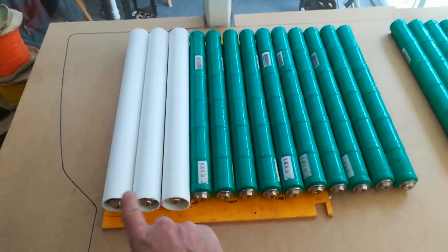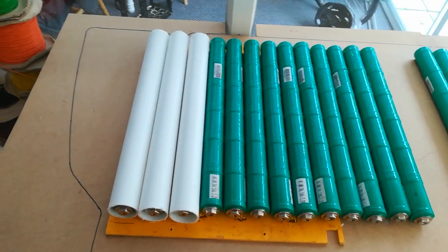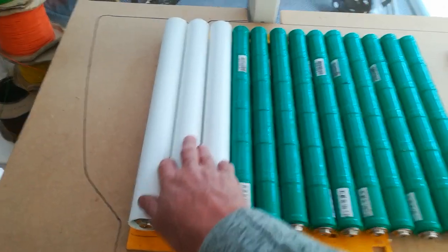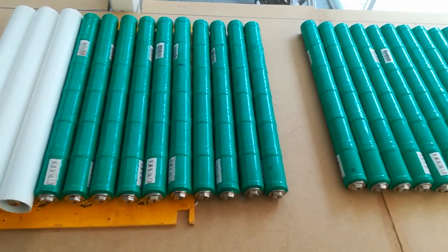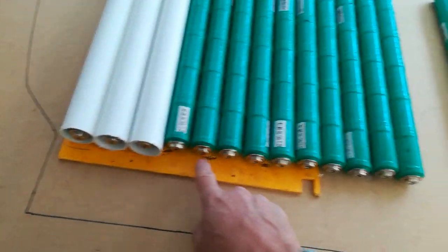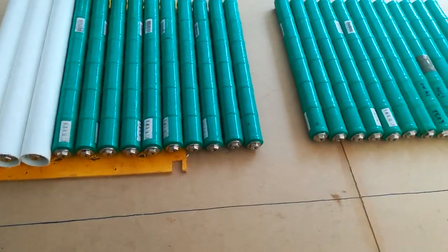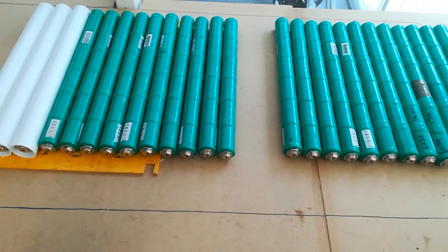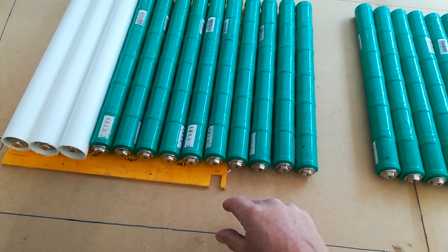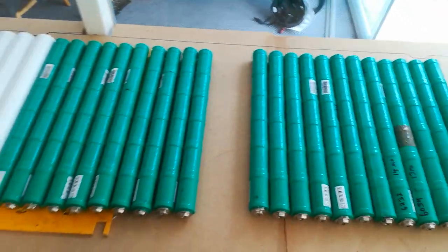Once you've got the tubes on a piece of board you can just stick them down with tape initially. With your sandwich on top and the edges all sealed up with expanding foam, that would seal all the tubes into the construction and make it very rigid — if you filled in all the gaps it would be really pretty strong. Probably still a two-man job to lift it without snapping in half, but you could also put some braces down the sides — a 50mm piece of one-by-two batten or wooden batten screwed in to make the box stronger.